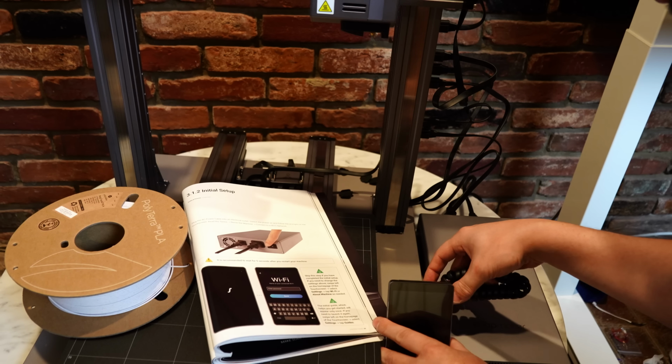I would say pretty much any other laser cutter on the market is going to be much safer than one of these 3D printer slash laser cutters. Because with the laser cutter, at least you always know that it's going to be in a certain plane pointing down. And basically the way that they designed this, you're always going to have reflective materials, fasteners. I mean, this aluminum, if you burn off or scrape off some of this anodized coating, then it's just going to be a perfectly reflective material that's ready to blind you at a moment's notice.